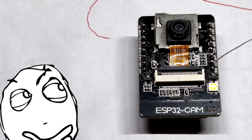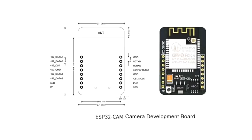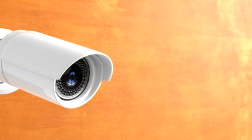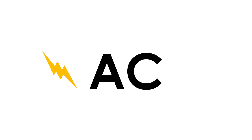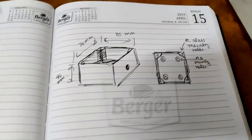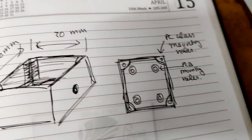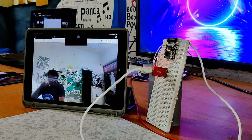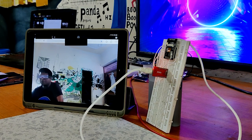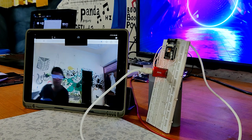The next step would be to make a breakout PCB for this setup, which will have an AC-to-DC 5V 1-ampere charger circuit on it — since I'll be placing it outside and powering it with AC. This setup will also have a 3D-printed body to house the custom PCB in a single solid package. For now, that's it — leave a comment if you have any issues during the programming step, hit that subscribe button, and I'll see you next time.